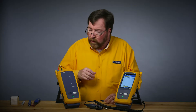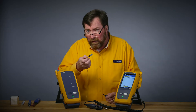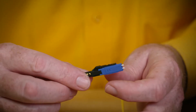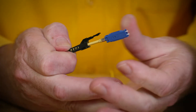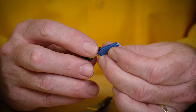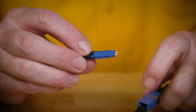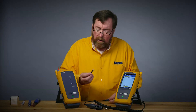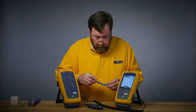What I'm doing is the test reference cord verification here. To pull the connector out, I need to pull it by the boot, and I need to reverse the polarity — otherwise I'll have transmit to transmit. So to reverse the polarity of the connector, I'm just going to hold the blue part, pull down on the strain relief, and rotate the connector. With a little bit of practice, you'll get better at sliding this in. There we go — it's locked in place. And now you can see that the MDC is upside down relative to the key. Because this was in the power meter and isn't making physical contact, I'm not going to inspect the connector right now.